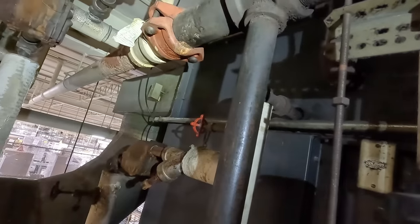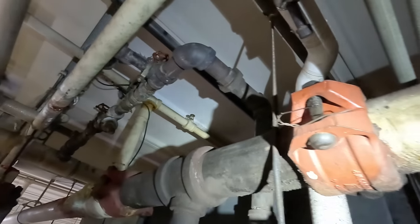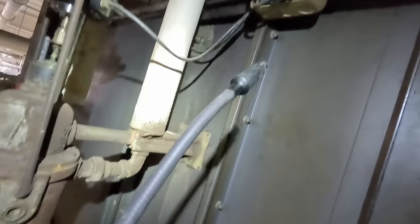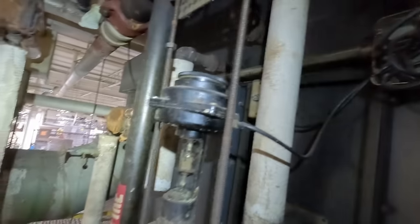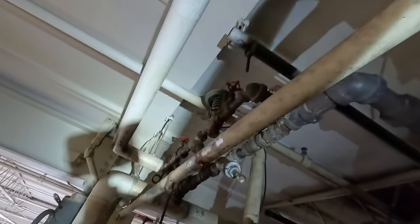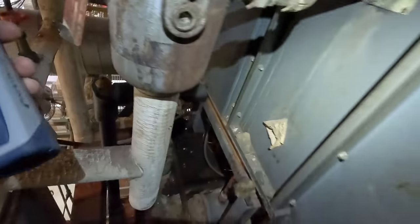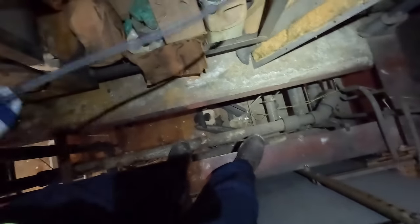That top area there comes across — there are the lines for the boiler. Right here is the fan; the fan blades are in here turning, coming through up through that area. The two ducts are going to be straight out to the office area from what I've been told — very similar to a VAV. You can see we got a little leaking there. There's an actuator right there. I'm trying to get my last scanning done — picking up something a little bit back here. I need to get inside there for a good read.